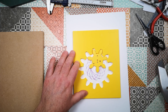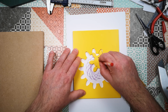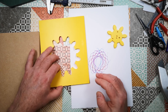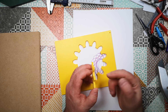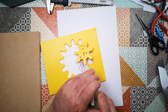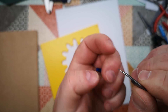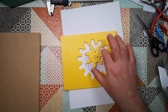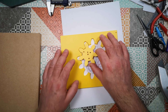As you can see, it's taken me only a day or so to get to the point where I've made the world's worst spirograph. We're going to do some more projects using this CNC. I've ordered some more bits so that I can cut the right kind of cuts — this has got a slightly beveled edge because it was cut with that V-bit, and in fact all of the bits they gave me in the box are engraving bits. They're really sharp, but I need a bit more variety. I've sent off for some end mills and some round-nosed mills, and we'll better do a bunch of different things, including perhaps some 2.5D engraving and maybe a few other things.